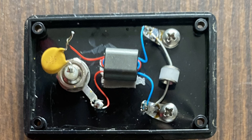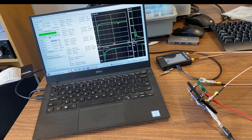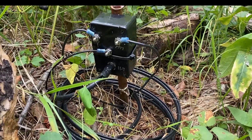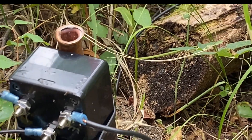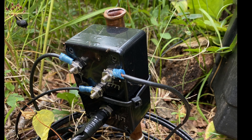Certainly a passive feed point using a transformer will be more robust, but I think these amplifiers are a game changer for perking up the output, especially in a phased array. At the feed point, I drive in a 4-foot copper pipe and leave 10 inches or so above ground that I can zip tie the amp to. These amps are looking for a very high source impedance, so a long ground rod or good ground soil is not required. You could also use a separate stake to mount the amp on.